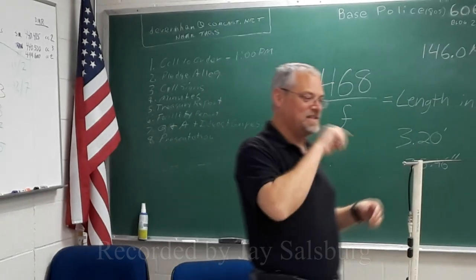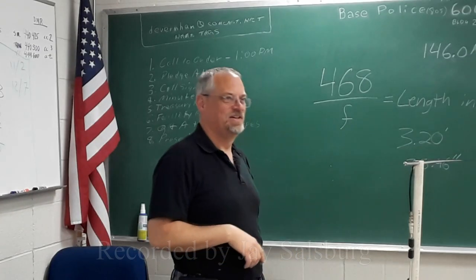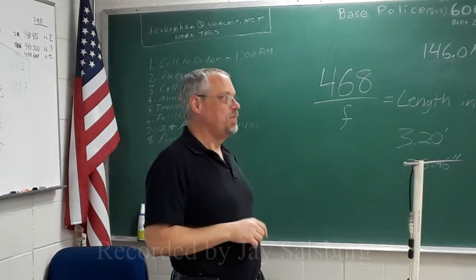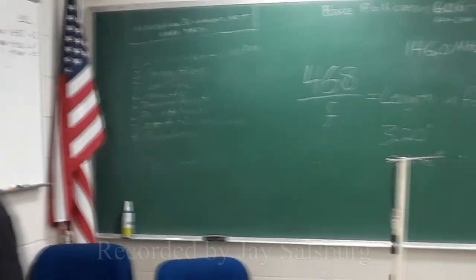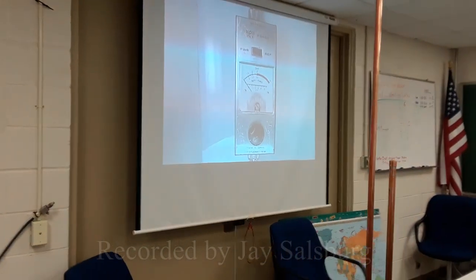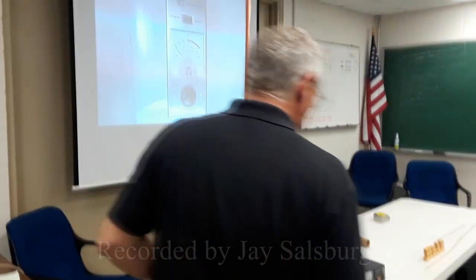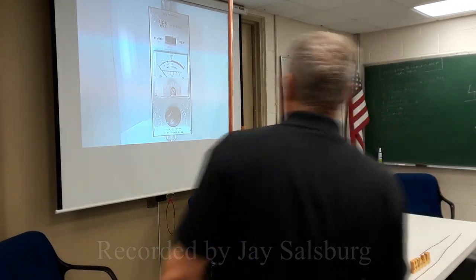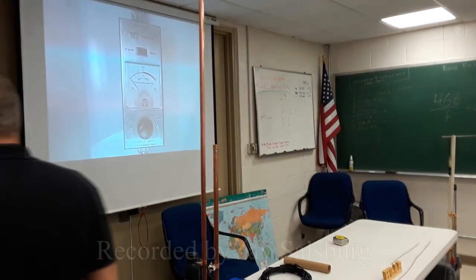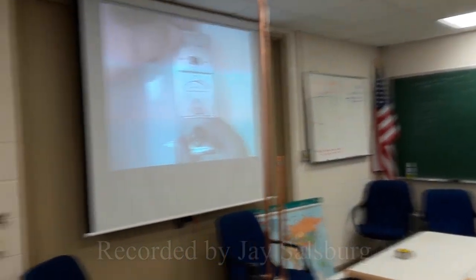Now, the question is, what kind of SWR am I going to get here? Probably not flat. So what I'm going to do, I'm going to start off with setting my radio to 146.52. Close enough. Can you be my radio operator? Sure. Go ahead and give that a key. And I'm going to set this forward. I have to bring this to full scale when he keys down for me.